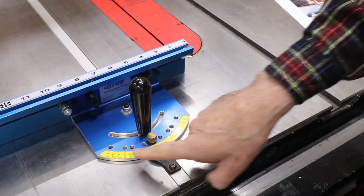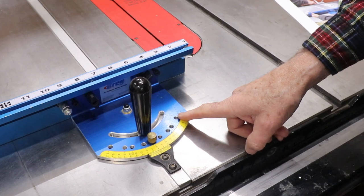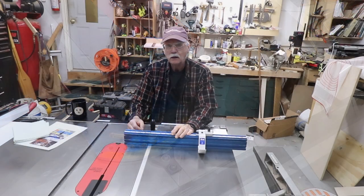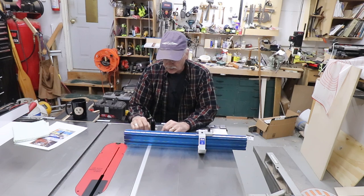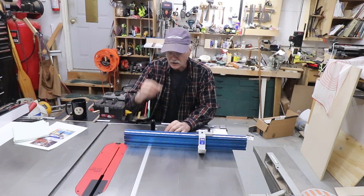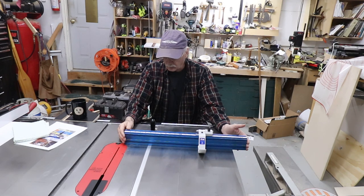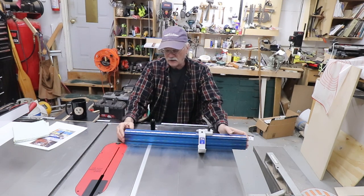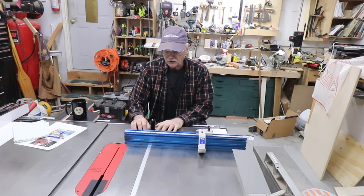What I'm thinking is going on here is these holes that are drilled into the miter gauge itself are off by a few thou either one direction or the other, so that the fence will not index completely and correctly with the miter bar. That's my assessment anyway. I linked Mark's video in the description — the Craig miter gauge review starts at the 16 minute 30 second mark. One more thing about the alignment pin and holes on the miter gauge itself: this is a very precise fit. When you slide those in and loosen it up, it does move a little bit, but when you push down on it and clamp it, it's right back where it was, and I found no problem with alignment after doing that. So either the holes in the back on the miter gauge itself are slightly misdrilled, or the hole in the miter bar is slightly misdrilled — one or the other.